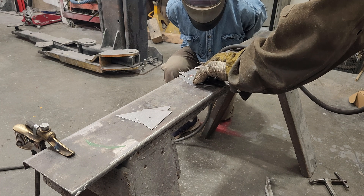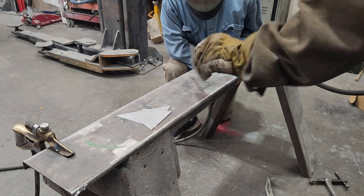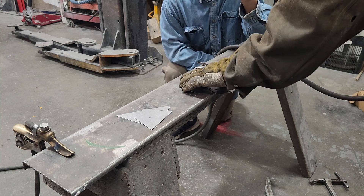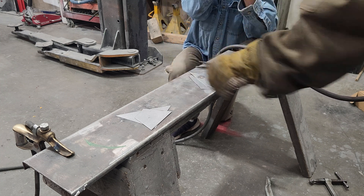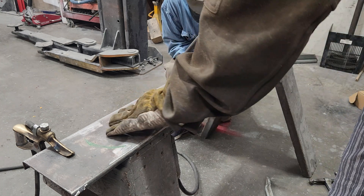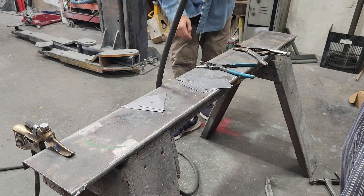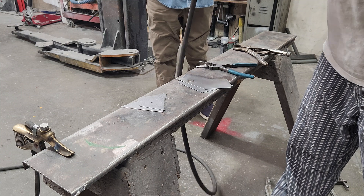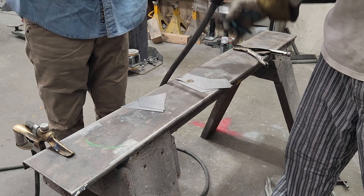And that's it. Nice and flush. You look at the back side — you've got total penetration all the way through it. I went a little deeper than I should have. I almost tucked it out of there. So, we're running 035 wire, which is way thicker than what we should be running. This is a hard wire with CO2 gas. I probably could have left it on that one pass, but you saw I wanted more.